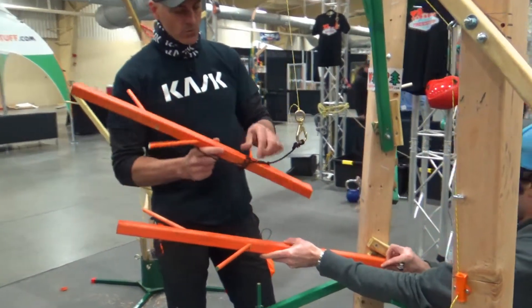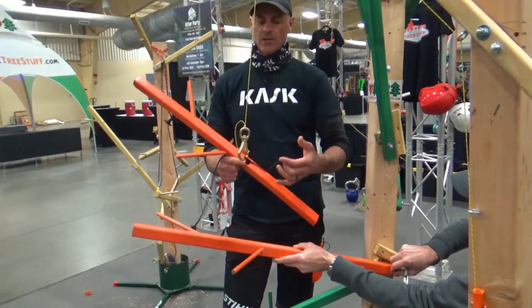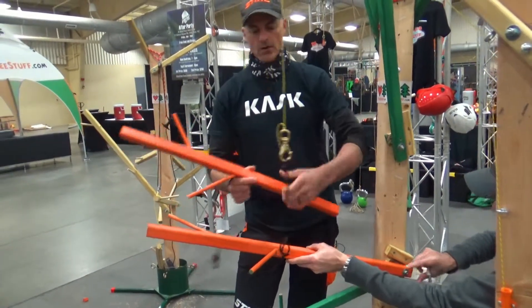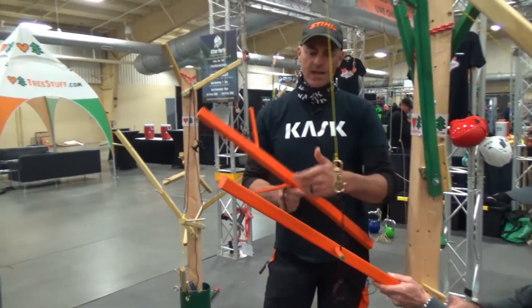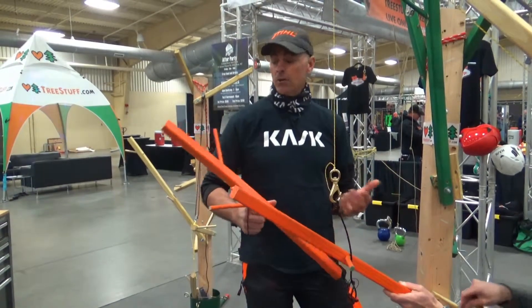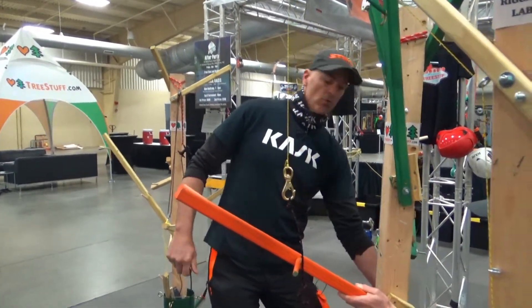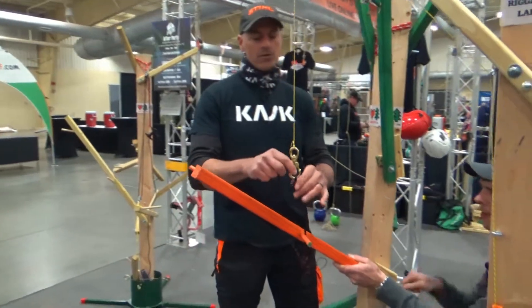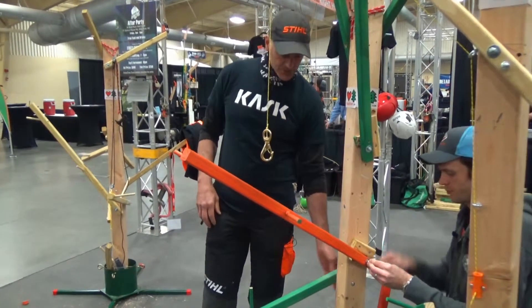When you get out in the real world and you see a scenario where it's difficult, it's not just the time waste where the crane has to come down, take the sling off, put the sling back on, wrap it, and it's not right — then you wrap it again in a different way and it's still not quite right. Then you say, 'Okay, it's close enough,' and close enough might be good, but close enough can also be dangerous. One way I found to deal with it years ago is using just a different type of sling.